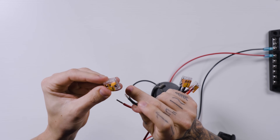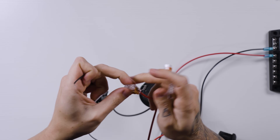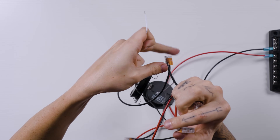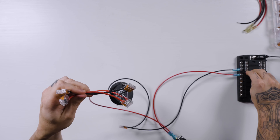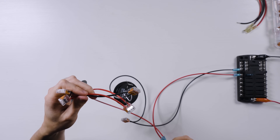Add more lever nuts at the far end. Remember, black is the positive wire for these lights. Connect the black positive wire and the white negative wire for this light. All connected. The wire between these lights could be pretty long — five feet, ten feet, doesn't really matter for the most part. Just for the tabletop demo, that's what we're using to get these two lights to different locations. Put the fuse back in place, hit the light switch, and we're good to go.